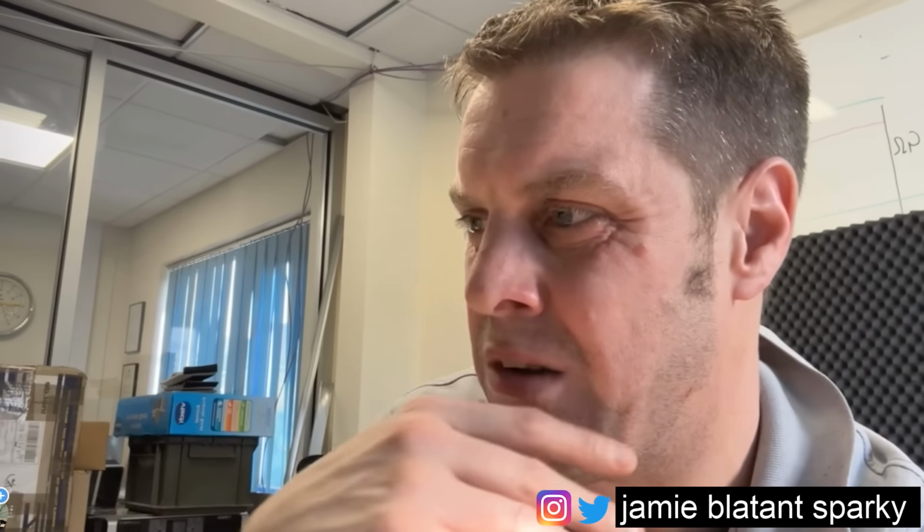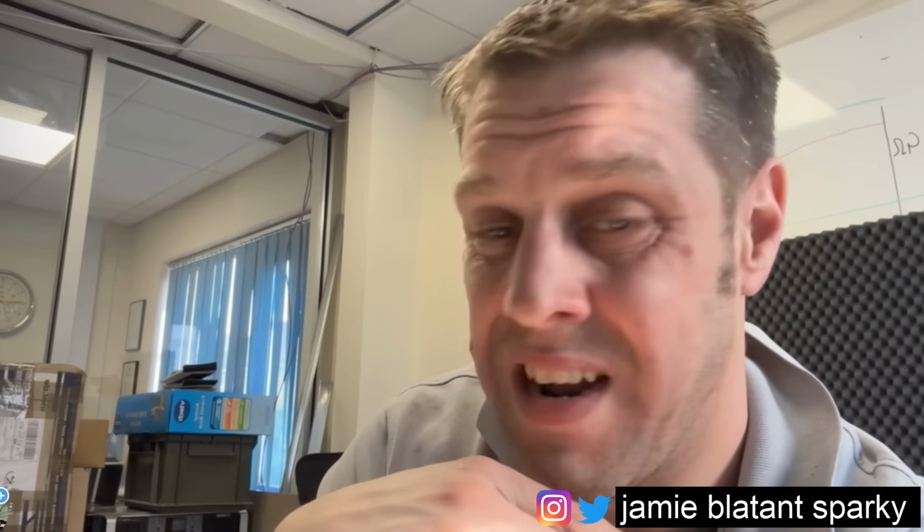Or if it's got moisture in it, you'll get a result on that. Like I say, you want your end-to-ends and your mega ohms. The reason I had in little spicy tests, another little test, is because I've played this game on site for real. And I know the problems you can get.